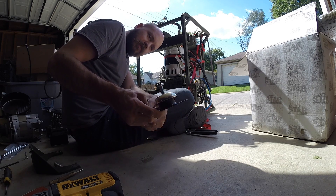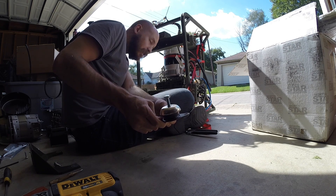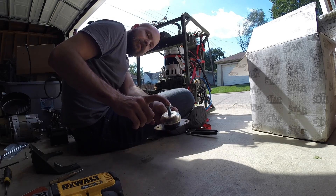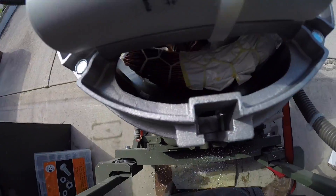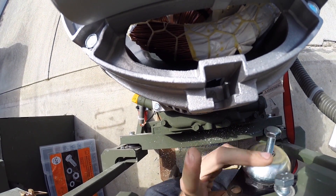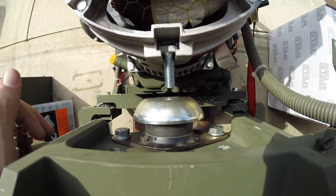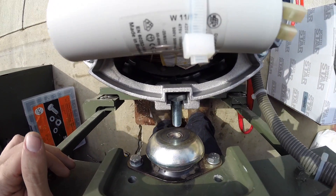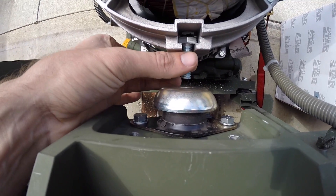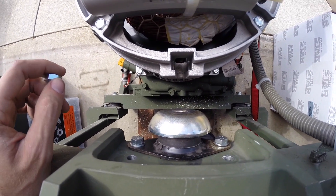The reason we drilled both those holes is to move this motor mount, or generator mount, slightly closer to the engine. Where it sat before, this bolt wouldn't go into the little shoe right up here. So we needed to move this down further so that it'll fit into here and support this end of the generator. I think it might work. Now we just need a longer bolt, maybe some nuts - to the hardware store.